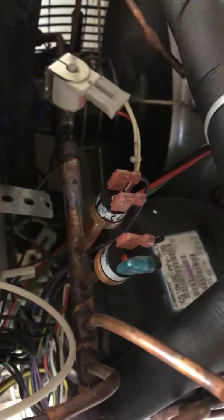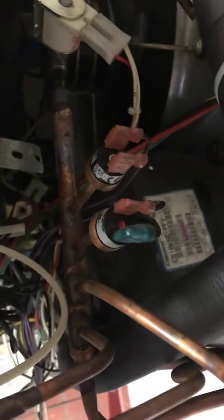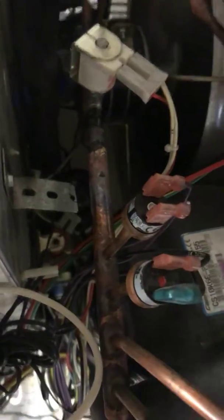It's going to run through the coil until it makes the ice, and then this ice thickness probe will indicate that the ice is full on the coil. One issue I also had was this sensor here — when it went into harvest mode, it kept the fan running, so it didn't do the proper superheat for the unit itself. The ice didn't drop when it went into harvest because the fan kept running, so I went ahead and replaced this, and it worked great for a while.